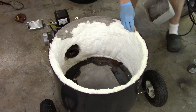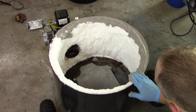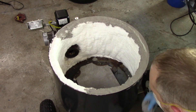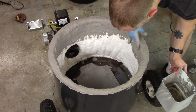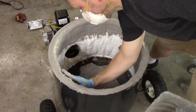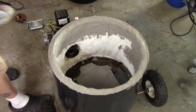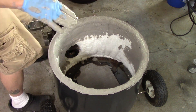I sprayed the fiber lightly with some water and then just spread the satanite on by hand. I learned to rub only in one direction when applying it and to lift my hand gradually, otherwise I would pull the fiber apart. A couple times I was left with ceramic fiber glued to my hand with satanite.